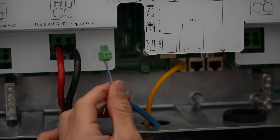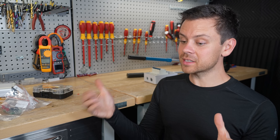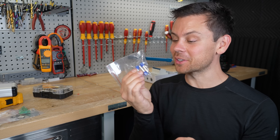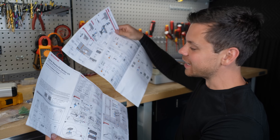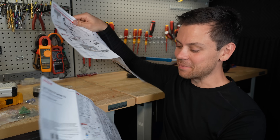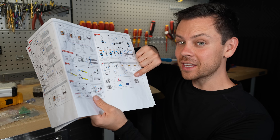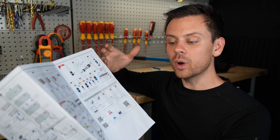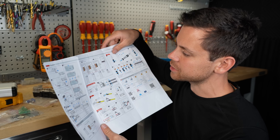I did not like the setup - why is there an ethernet cable I have to splice? It should use a standard plug-in ethernet. When stacking the batteries, the plug connecting them has a waterproof gasket that arrived damaged - all shriveled up - so that stack of batteries is not waterproof now. You need to make the ferrules perfect with the right conductor size or they won't fit, so you have to read the instructions. The instructions are not great - they managed to fit everything on single sheets of paper: mounting, commissioning, everything. The commissioning section just tells you to download the app but doesn't give the installer password, what you need to set up, or where to go. There needs to be a quick-start guide in the app. The terminal resistor section is also a bit confusing.